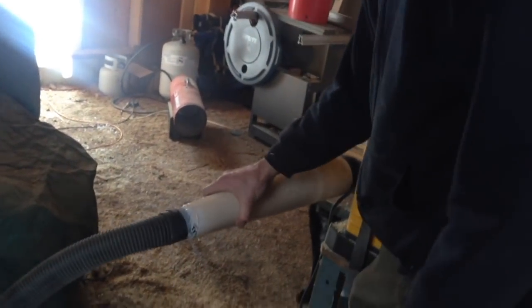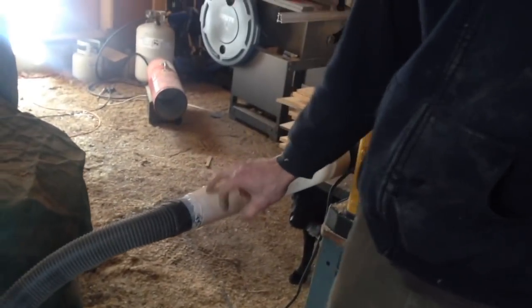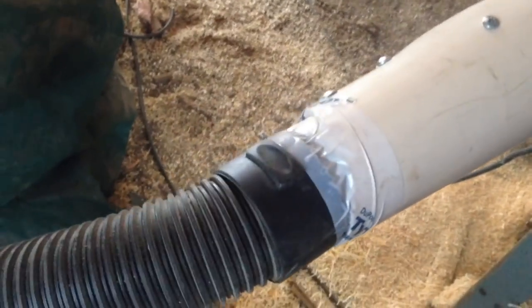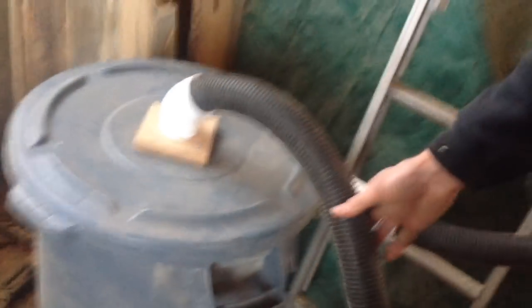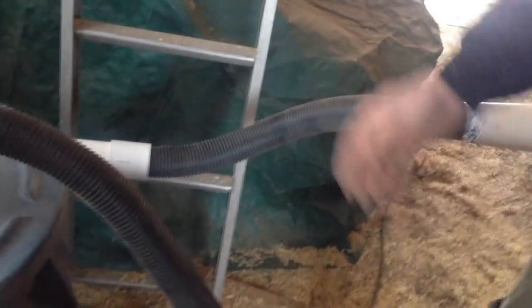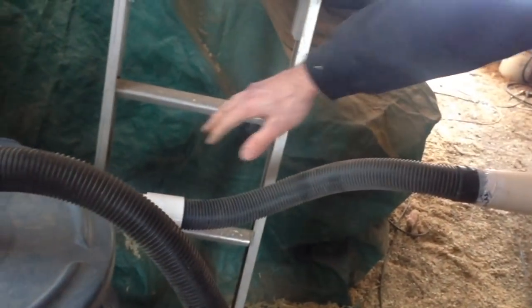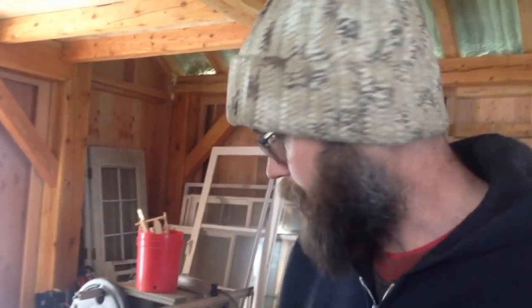That fits on there nicely. There were some air leaks around the hose-to-cone fitting, and I just taped that up with some Tyvek tape — not a big deal. So this was all one 8-foot hose, and I just made a cut in it about 2 feet down the line. If you were using this for cleaning up the shop or any other thing, you might want two hoses or leave this end longer. But I made this specifically for hooking up to the planer, so this is a nice setup.